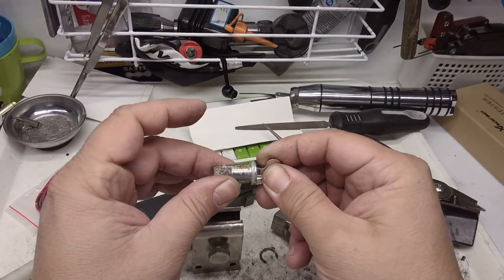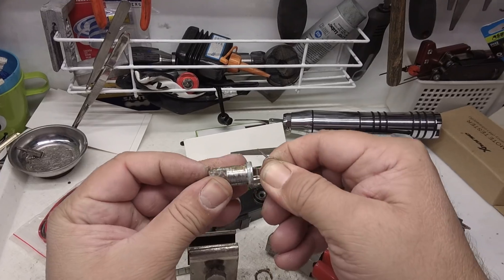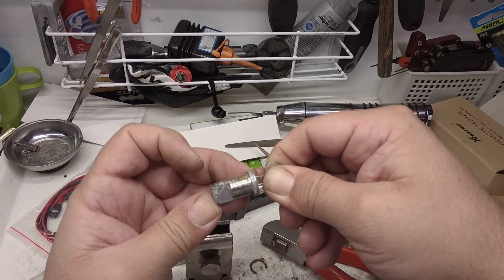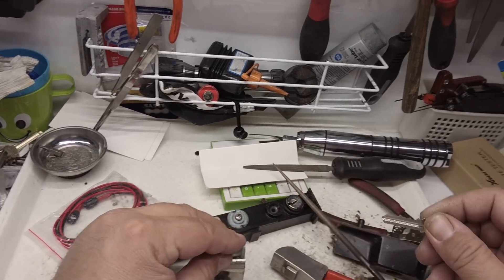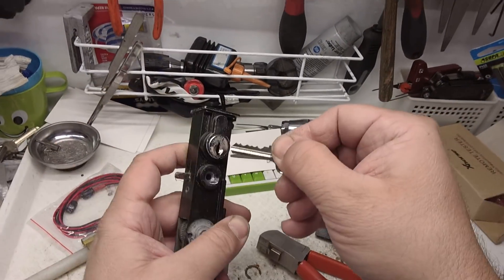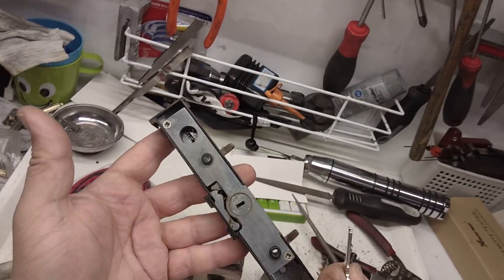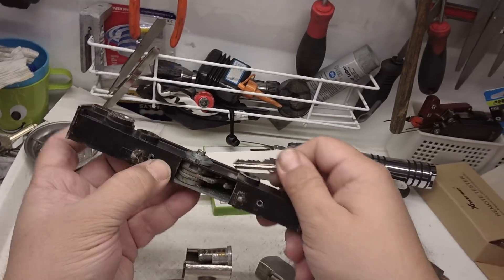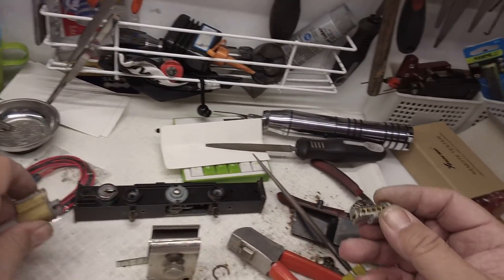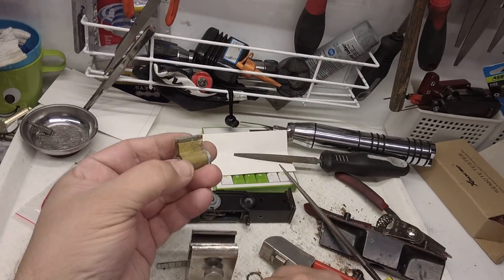My file is getting a bit full of brass as you can hear. I'm pretty happy with that now. There's a bit of movement in the plug — if you push it all the way down these pins come up and these ones go low. If you sit it in there normally it's nice and flat. The moment of truth — yes! Works beautifully. Saves me having to pull this apart. Anyone who's pulled this apart knows you've got all these little parts that slide up and down with old grease. Even though this one was full of ant poop, we still got the third option sorted.